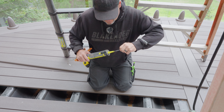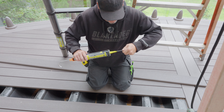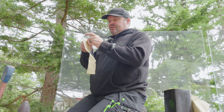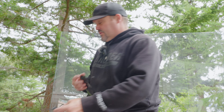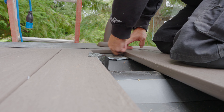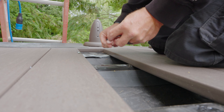This stuff's pretty good — even if you don't seal it, you can unscrew the cap and put a new cap on it and just keep going. Now that all our sealant is down, I'm going to take some strips of G-tape and make little squares to cover each hole where the new screw may penetrate. I'd rather do this and be super safe than just run the sealant on there and say 'that's probably good' — that's not going to work for me. I've got to make sure these holes are never going to leak. Water finds the path of least resistance, and it's not going to be where these holes were because there's a lot of resistance where those fasteners were.